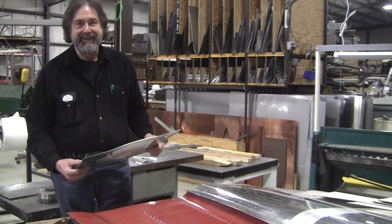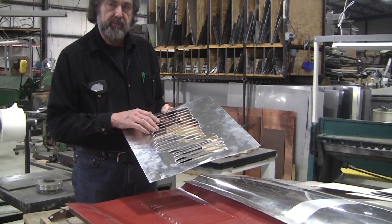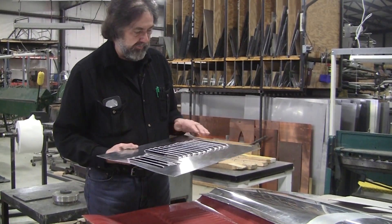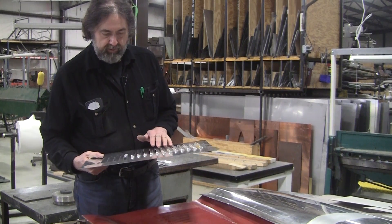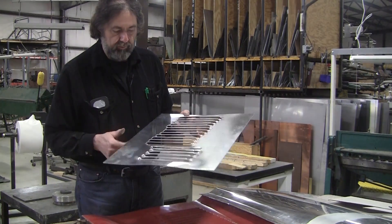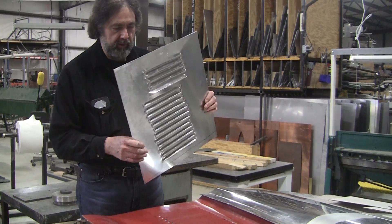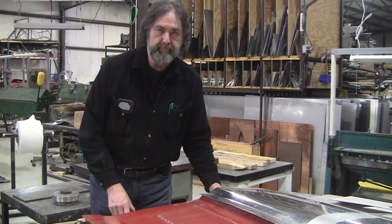It turned out the five-ton didn't cut the eight-inch, so we had to go up to a ten-ton cylinder. These are some of the first cuts with the eight-inch die that Frank did — there are a few little mistakes and we still need to tune the die. Frank's been working on that. Let's go take a look at the louver press.